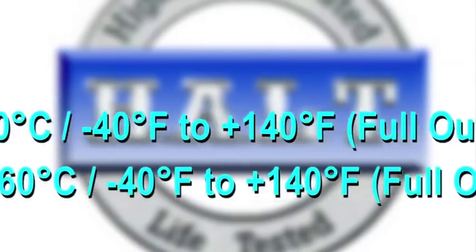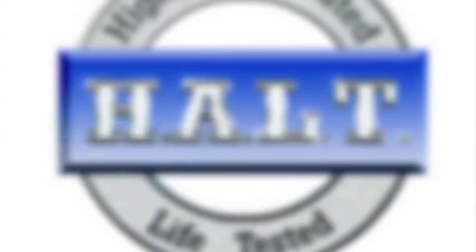Another key aspect for mobile application is the vibration stress. The specs required for UL458 compliance is 10G. During HALT, the product was tested up to 15G. In addition, the combination of temperature shock and vibration allows us to identify manufacturing deficiencies such as solder joint defects.